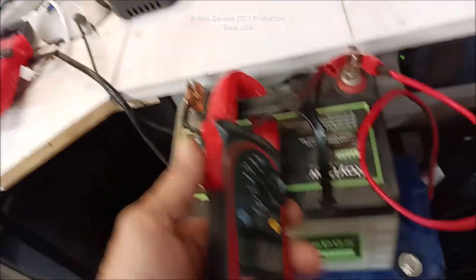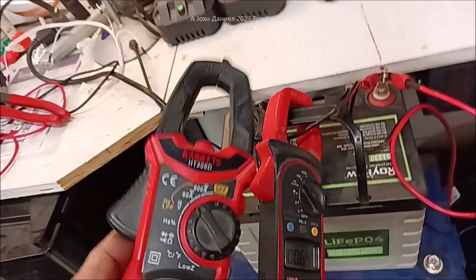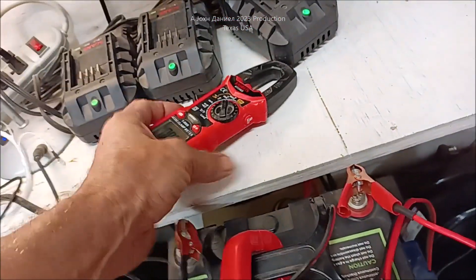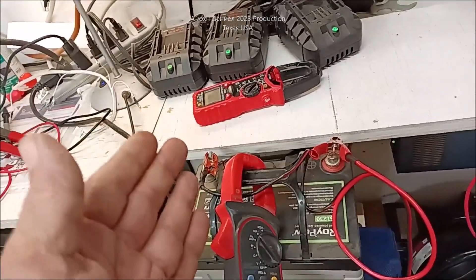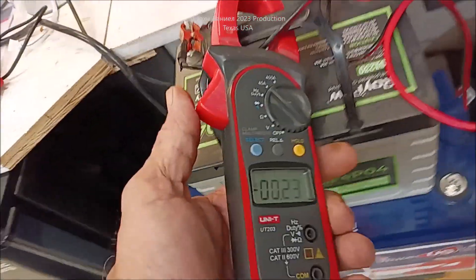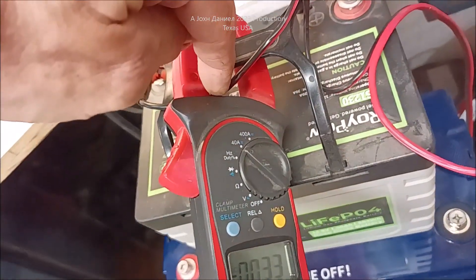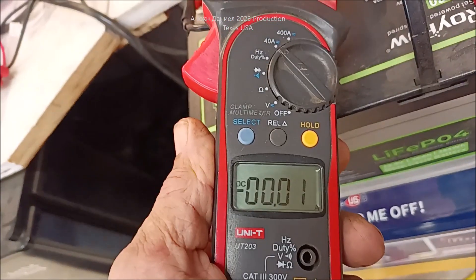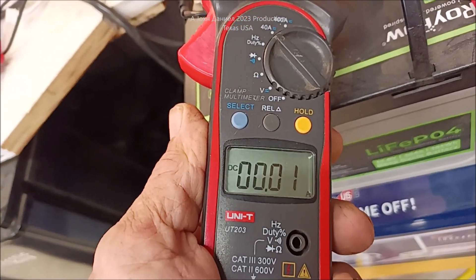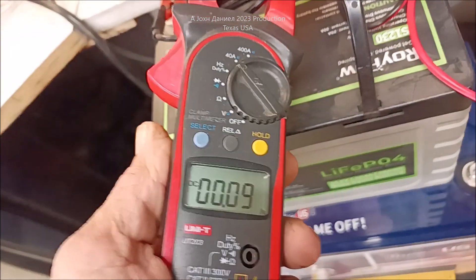Let's go over here and get more plain-spoken about it. I'll use my little Unity meter — I'll put a link to these; these are the ones I use professionally and you don't need a $300 Klein or some other fancy brand. These are actually extremely good. I'll show you a characteristic you probably never knew about with clamp meters. It's a DC clamp meter function — it'll act up and I'll show it to you. Right now power is also back-flowing. If it were forward it would go that direction, but watch — now it's flowing back into the battery because the solar is starting to pick up.